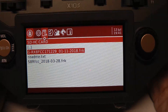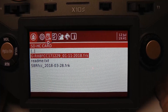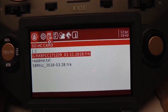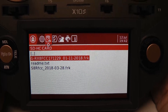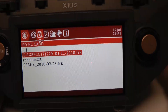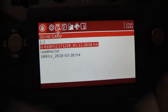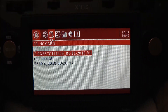This method is much easier than dealing with Windows and downloading and installing USB drivers on your computer, and then playing this timing game trying to get the STK to see the receiver. It's kind of tricky. This is not tricky — it's really simple. And what's nice is the firmware is now on your transmitter, so if you're at the field and a friend needs a firmware update on their receiver, you've got it in the transmitter. You can do it at the field. No Wi-Fi is needed. It's really a very neat feature.